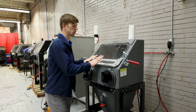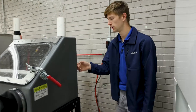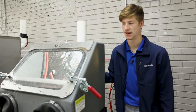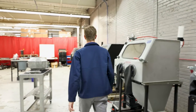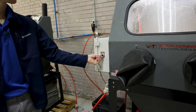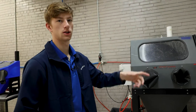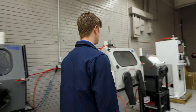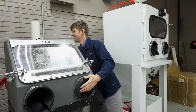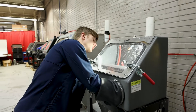When actually using the machine, to turn the lights and pump on, on something like the 700 it's going to be on the rear — you can see these two switches for the light and pump activation. On something like an 800 you've got the main switch on the side. On the Weekend Warrior it'll be a similar style box on the left hand side. With the 700, I'm going to go ahead and pressurize it, and at this point you are actually ready to blast.